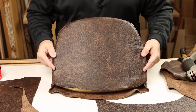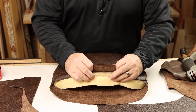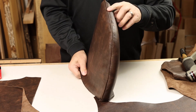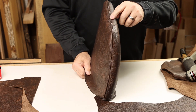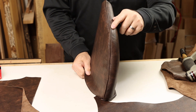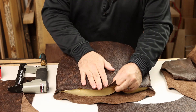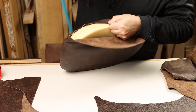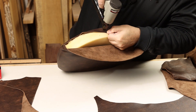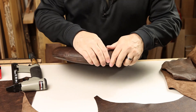This is the back of the cushion, so we'll draw that back panel down keeping an eye on how far that pulls the seam over towards the back. I just want it to land right on top as a real natural look. So once we have any of the wrinkles worked out, we'll set a shot or two down into the bottom of the plywood and double check the look at the top.